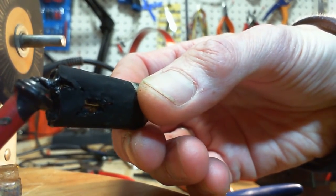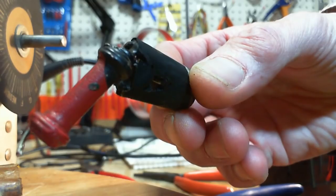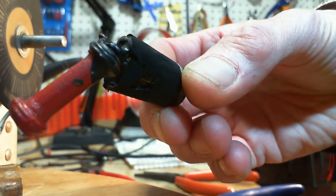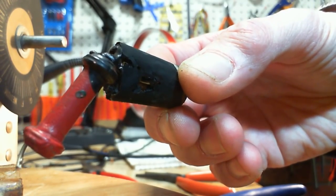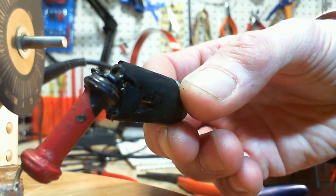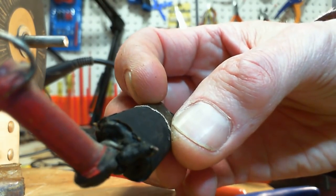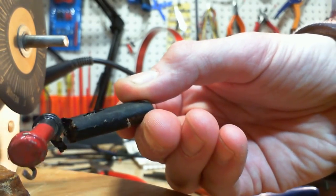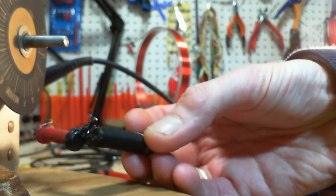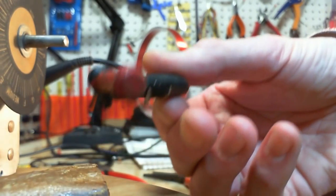And there's the resistor. You see body and dot. Get in the camera here. Body and dot. Red, black, black. Red 2, black zero, so 20. Oh, the black on the end isn't the black, it's black that's leaked out of the capacitor. So body, end, dot, this really should be green on the end, I think. Maybe not. No, who knows? Anyway, it is what it is on the schematic.